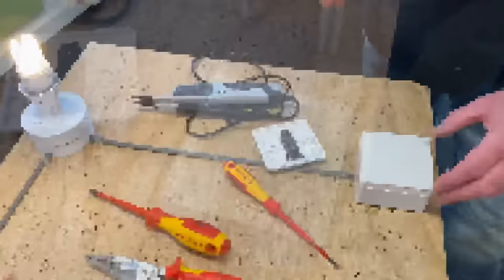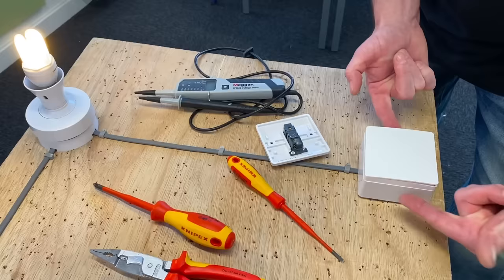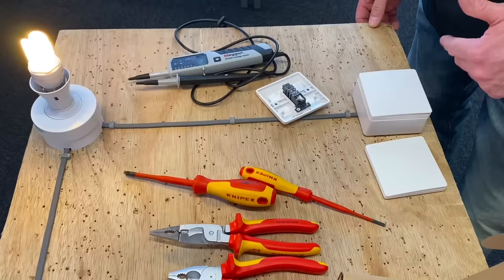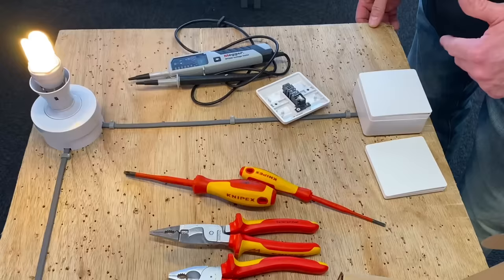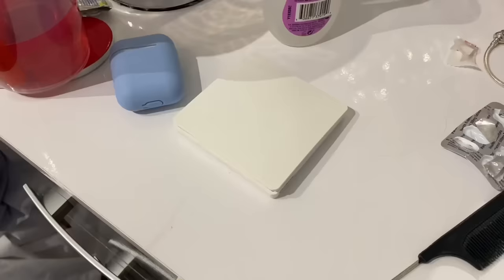We power it back up and see it as a one-way switch — super simple. Now we want to introduce other switches without cables, using kinetic energy that sends a radio frequency picked up by the receiver to turn the light on and off. We'll see how to pair other switches next. These switches need at least a five-watt load — I've got a seven-watt lamp, but five watts is fine for most fittings. It will switch up to 600 watts of LED or 900 watts of resistive load.